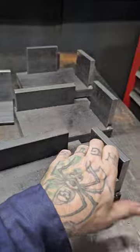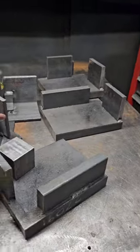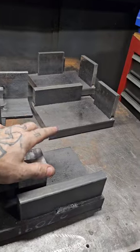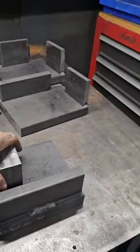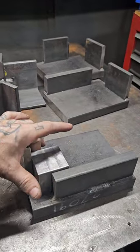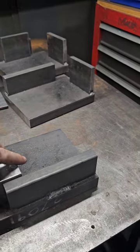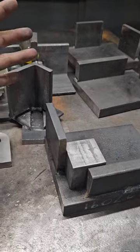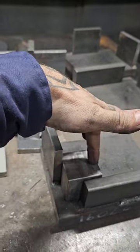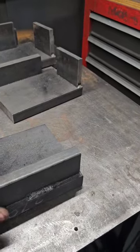These right here — I needed to make a square, so I made four of these and had a perfect square. In the corner of each it needed a precise 2x2, so I quickly machined up a 2x2 block and put the piece up against it, clamped it all down. Same thing on the other four corners.